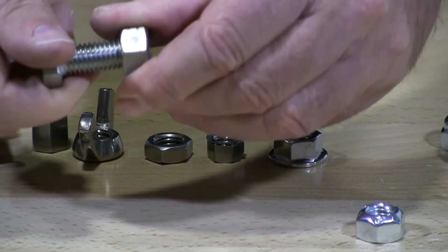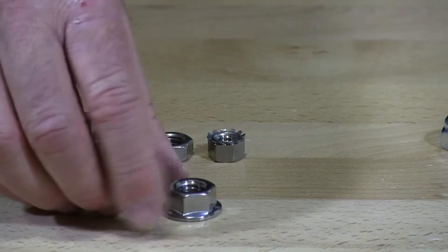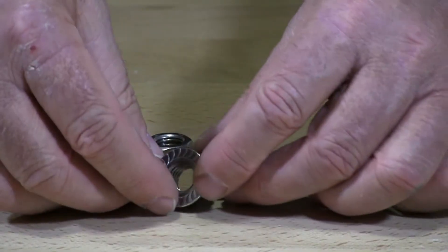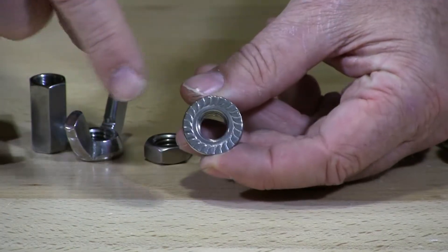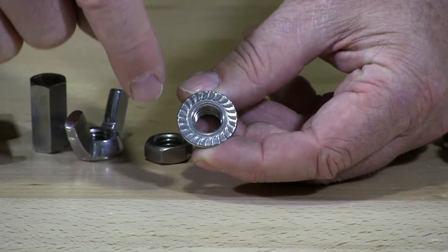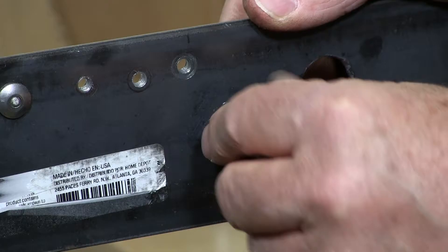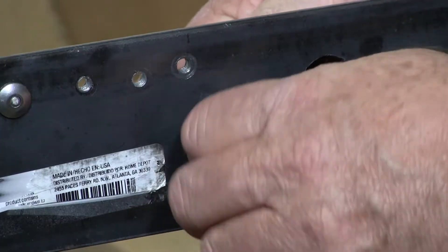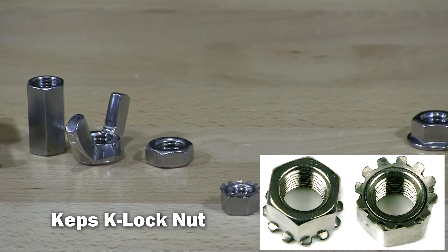I just reached it now — either way I put this on it's going to start locking. A serrated flange nut. It has an integral flange built into it, and on the backside you can see that it's serrated. That's usually used in applications where you have some type of metal sheeting, and you tighten it down and those serrations prevent it from backing off.